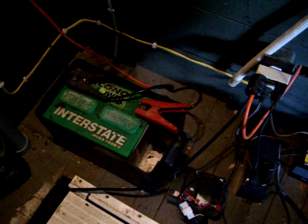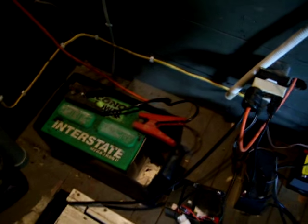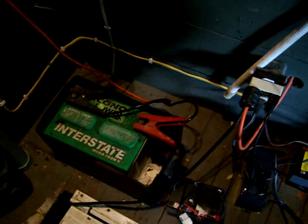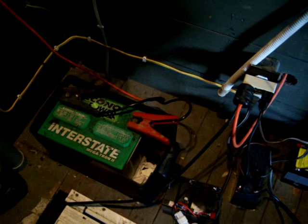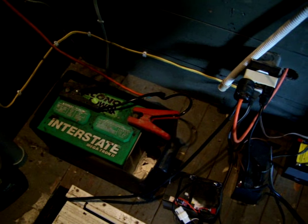I have a main battery, which is also a car battery out of a vehicle that I don't bring with me. That operates a refrigerator and a medical device I have, so it has to stay fully charged. Once the evening drops and the voltage drops below 13.8 volts, the house is disconnected from the main battery.